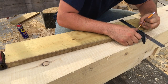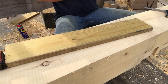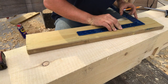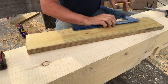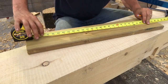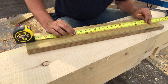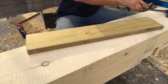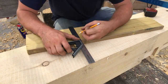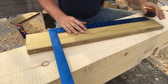This time going down I'm gonna measure one inch. I'll use the tongue of my framing square, come over my 16 inches, double-check it — right on the money — then come down two inches and connect the dots.